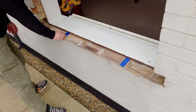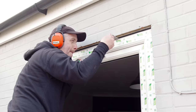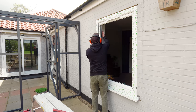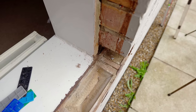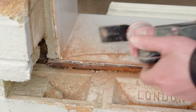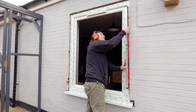I place some 5mm packers on the brick and then it's the daunting moment to see if the window will fit — but it slotted into the opening nicely. I can then pack out the rest of the frame, putting the packers wherever there will be a fixing later so that the frame doesn't distort when the fixings get added. With everything held in place with the packers, I check for level. The first reading was great, the second reading was great too, but the third one was way off. This meant I needed to remove the window again, which didn't go too smoothly. Fortunately nothing was damaged. The problem was the back edge of the internal sill was stopping the window seating properly — it needed a good 10mm taking off it, a perfect job for the multi-tool. This time I siliconed my bottom packers in place to stop them moving around, and I can then get the window in again. And this time it was bang on.